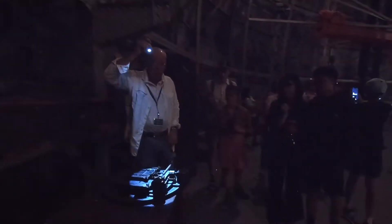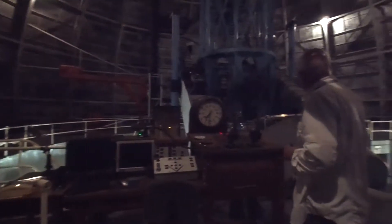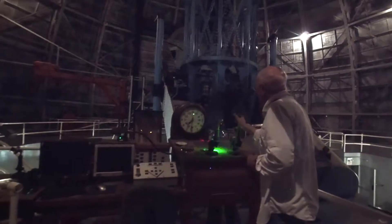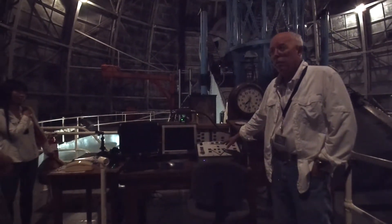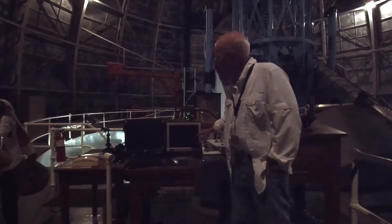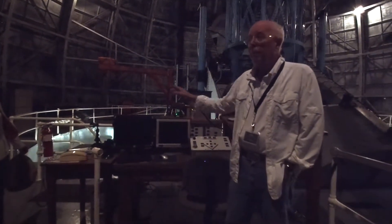These telescopes are photographic instruments. This is the film mounting plate that allowed the operator to see the engravings on the rings around the right ascension and declination axis. Watch what happens when I point this in here — you can see the optical path: light comes from here, here, here, and then down. There's an engraved brass ring — once it's set, it tracks. This is the third generation of electronic control, designed and built by volunteers here at the observatory. It controls the telescope and the dome. This screen shows the actual right ascension and declination as well as the altitude and azimuth. And that's just a plain old PC, but it has a planetarium program on it so they can pick their targets off of that.